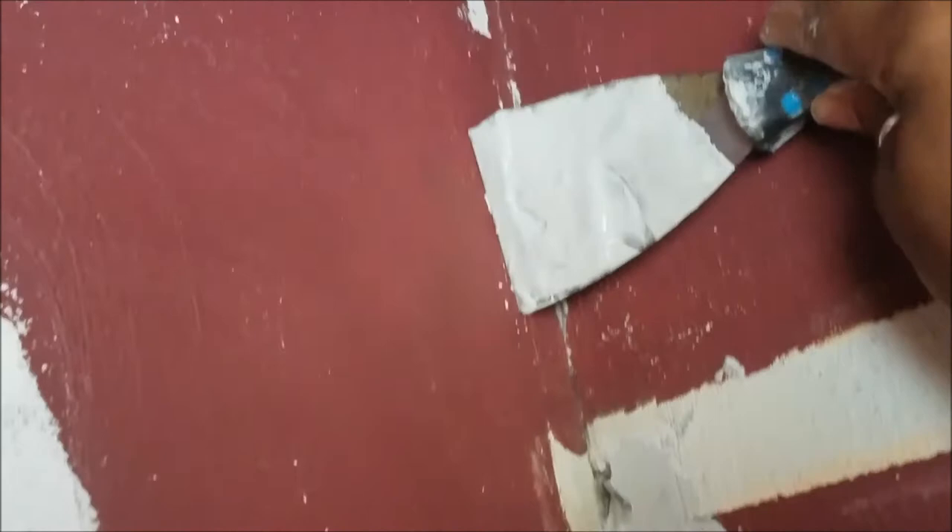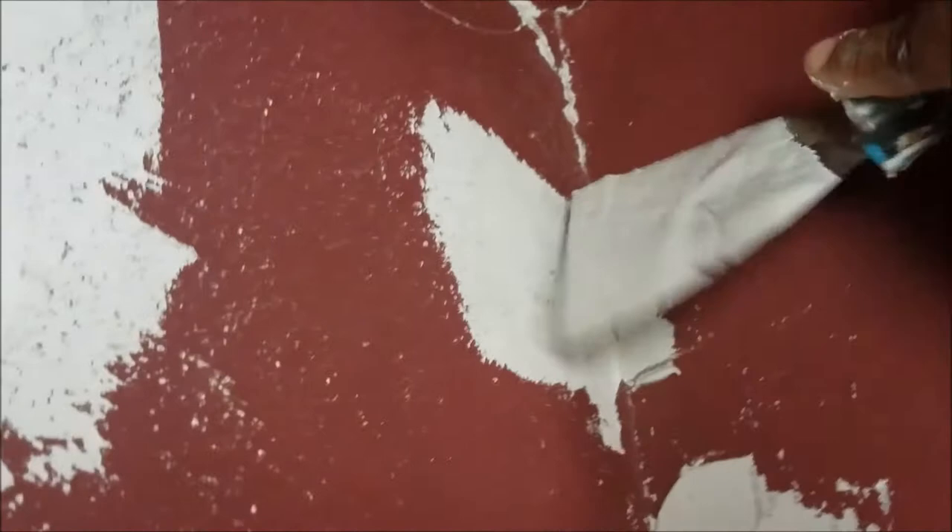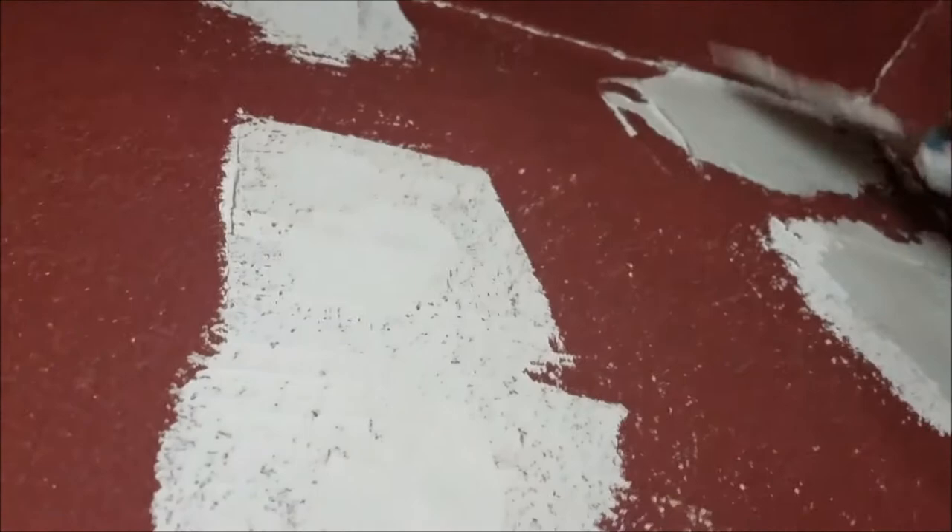Here's a corner area where nails were pulled out of different boards. You just press and ooze as much joint compound into the holes as you can, then skim back out — press in and pull back. That's the easy way to fill corners or any area with a corner. Some of the plaster was also peeling and chipping in this area, so I'm pressing the compound down to make it stick and not chip or peel.